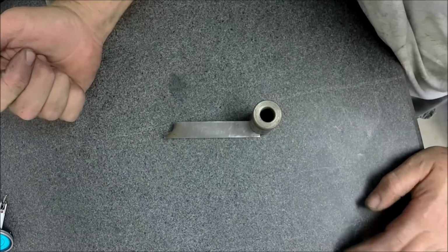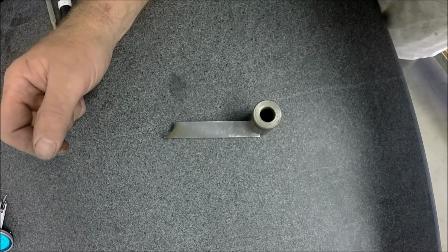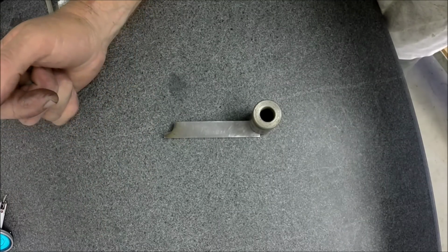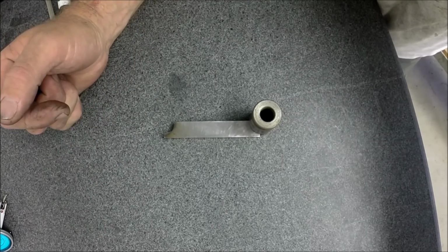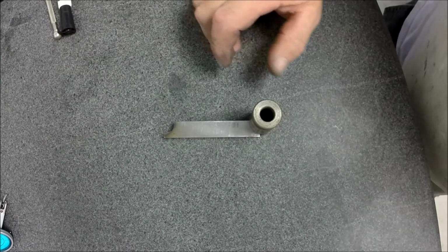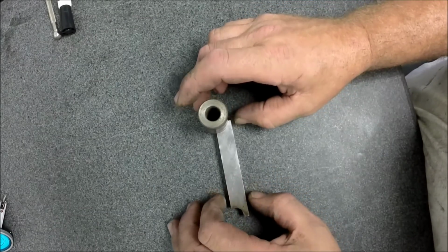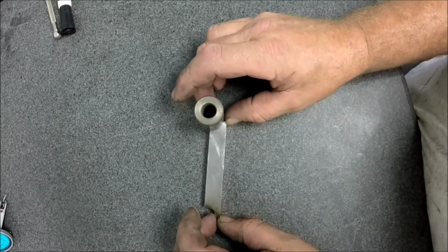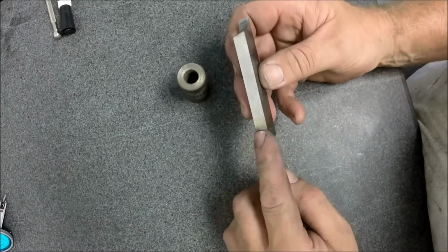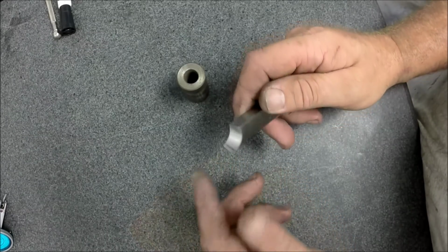And I had some wheel degrading problems with the pink wheel, and I actually had to go back. I switched over to an aluminum oxide, straight aluminum oxide, no fancy rubies or diamonds or emeralds or anything like that. But I think with the wheel degradation gone, we've made a really good fit. Last thing we need to do is check this on the lathe, and I'm going to do that before I grind this. I'm going to stick it on the lathe and cut a piece of bar with it.